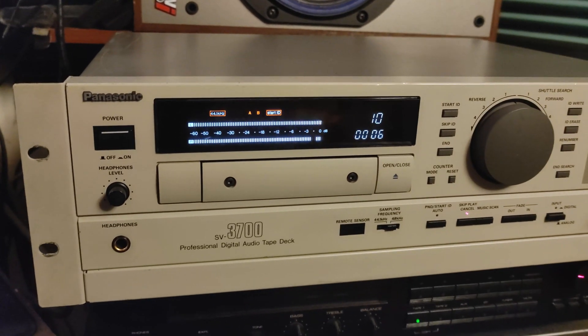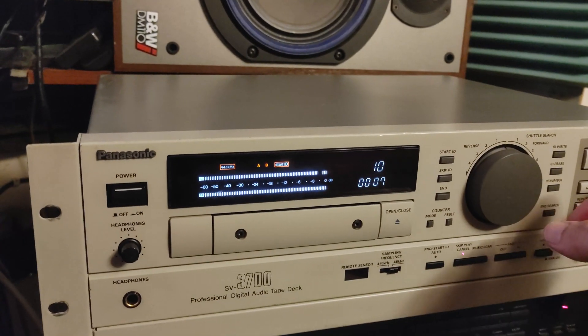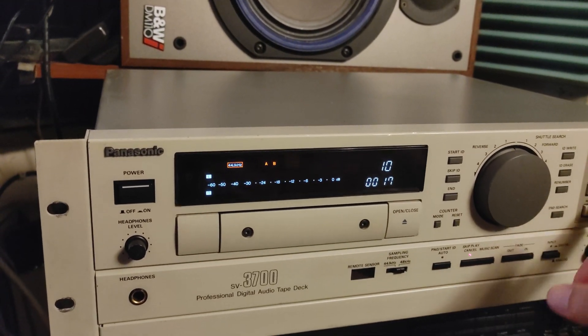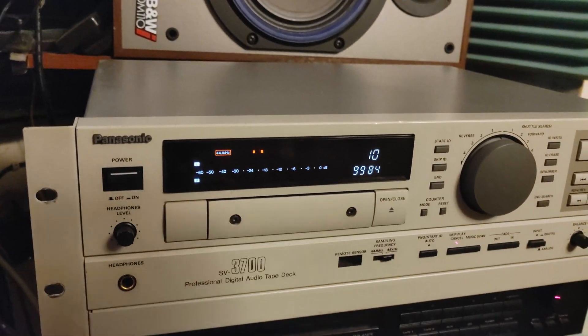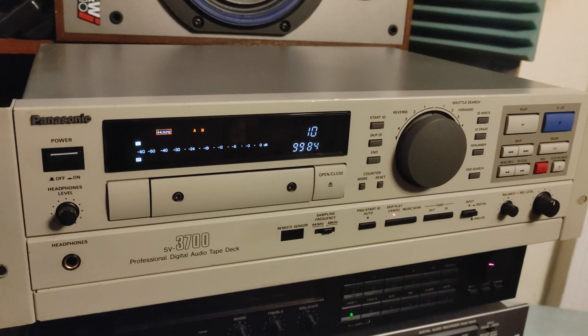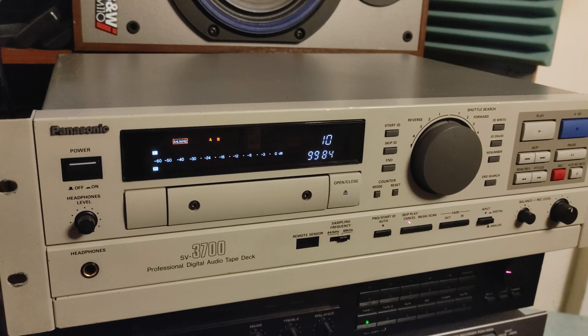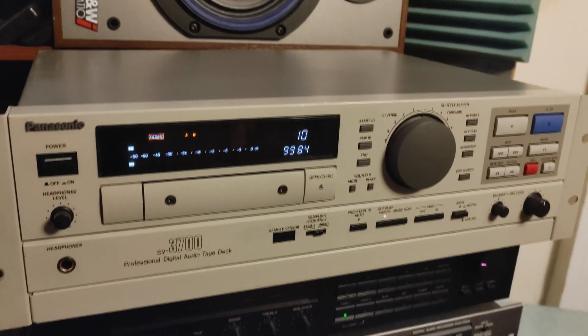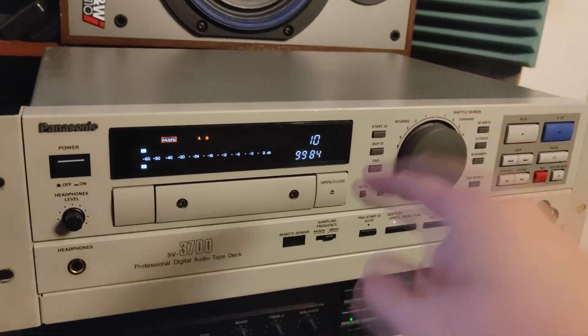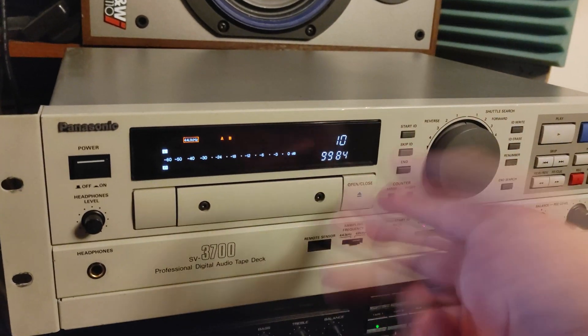You can see the very low error rate while the tape is playing. That's the first thing to check — if the DAT head is not working properly you'll hear drops, distortion, no sound, or clipped sound. But if everything is working just fine and you want to be sure, the error rate being low confirms it. There is that hidden menu for this.